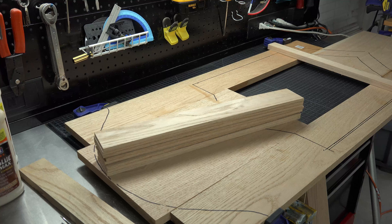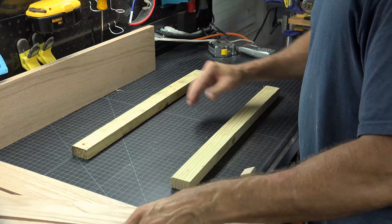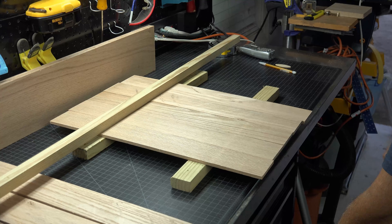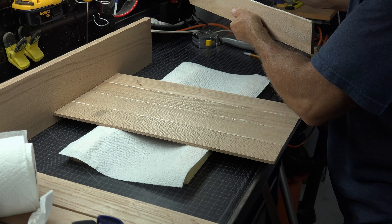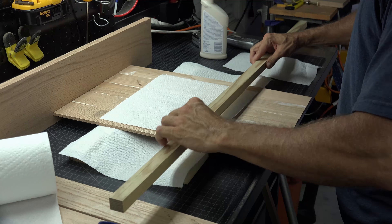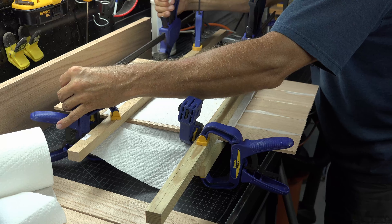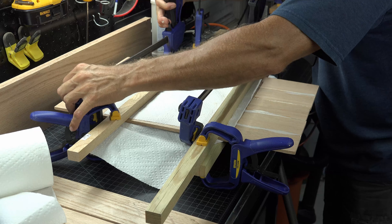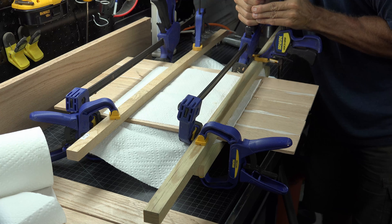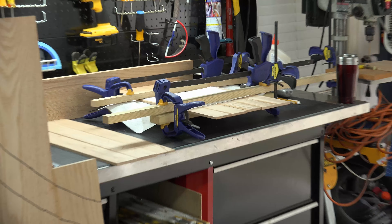She said do your thing. So I wanted the master sergeant stripes to be a quarter of an inch thick, whereas the reference picture had them at least a half inch thick. I cut two six-inch wide pieces at 21 and a half inches, shaved off a quarter inch, and cut them in half to produce five quarter-inch thin pieces, which I would glue together to give me a 15-inch by 21.5-inch square. I rigged a contraption of scrap wood and clamps to keep pieces from bowing when squeezed together, laying a paper towel between the scrap wood and the stripes so oozing glue doesn't attach to the scrap wood — later I can simply pull the paper towel off and sand any remaining paper away.